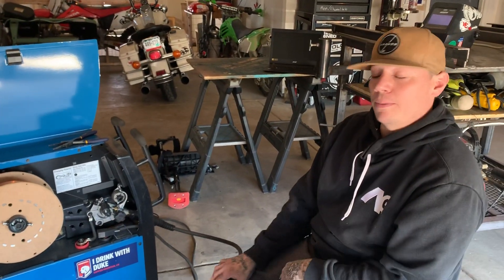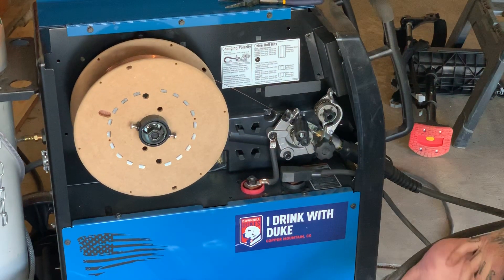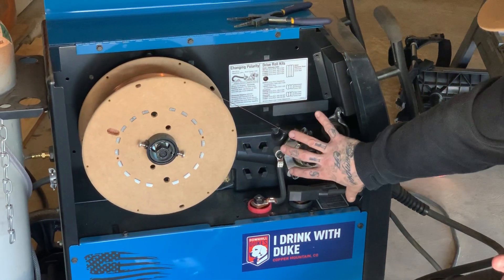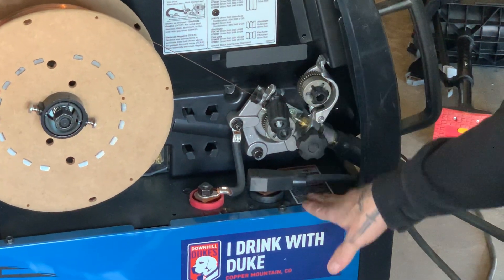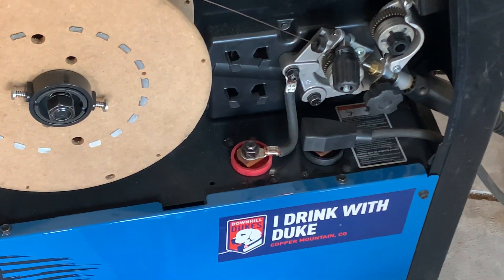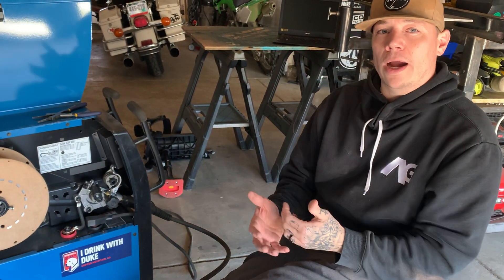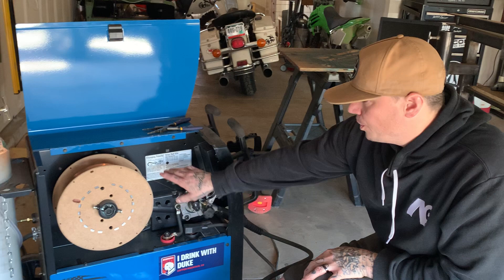Porosity is the first thing that shows up when you lose shielding gas. This is where our power comes into our drive roller assembly, gets transferred into our hard wire and contact tip to create that arc — giving us the heat to melt the workpiece and add filler metal. Right now I have this set up for direct current electrode positive, or DCEP — that's when my drive roller assembly is hooked up to the positive terminal and my ground is hooked up to the negative terminal. You're going to run DCEP on all hard wires and also on dual shield flux core wire where you're using a shielding gas. You would switch to DC electrode negative only if you're running flux core wire without any shielding gas. But for the most part, these machines are always going to be DC electrode positive.